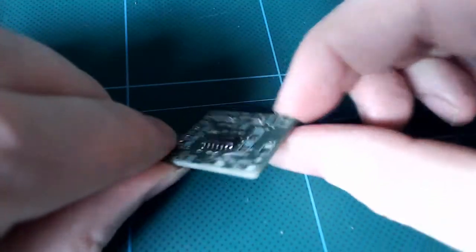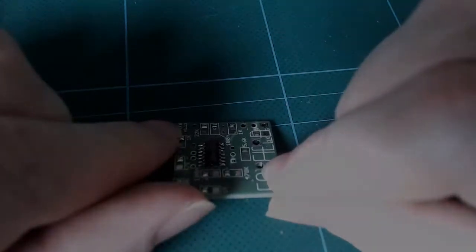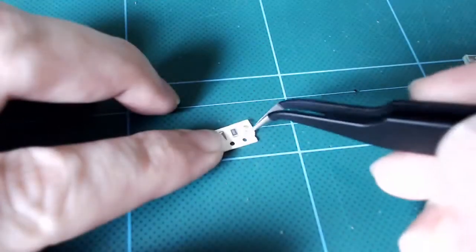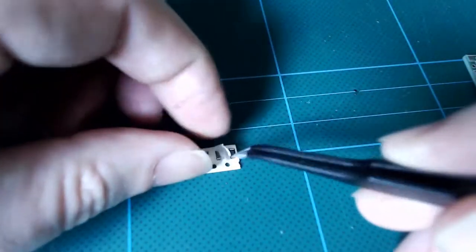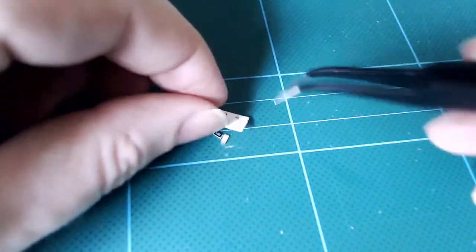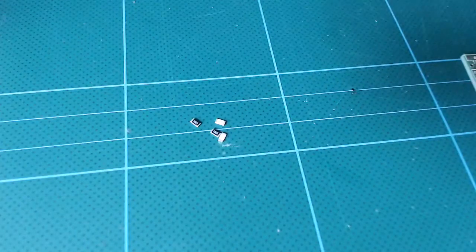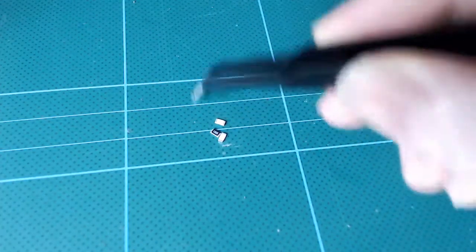Now we'll solder all the resistors and capacitors on the back, these little passive components. These are much easier than the IC. So we know which one goes where from the build document and the silk screen. The values of the components are written by them, sometimes with a line to indicate where they go. And the resistors are all marked with their values. The documentation will tell you which bag each resistor is in and exactly what the label on top of it will say.